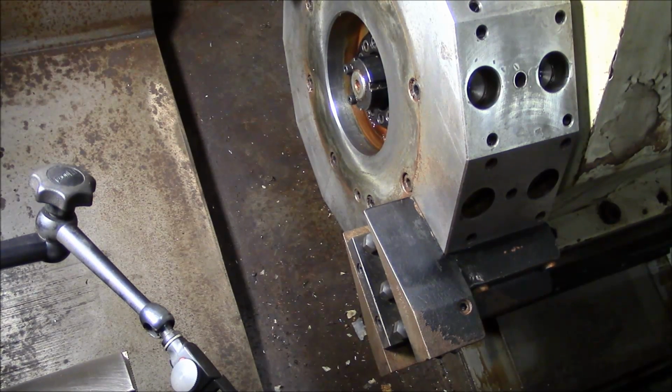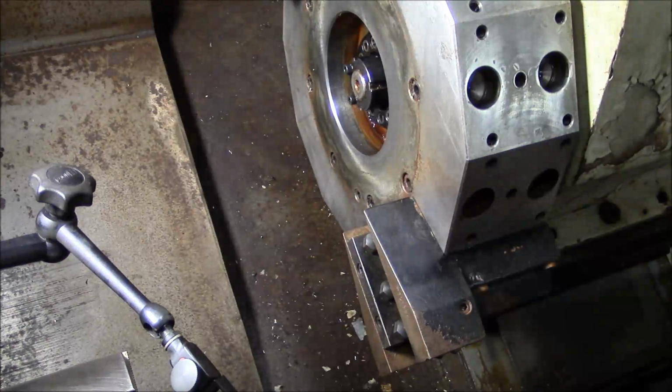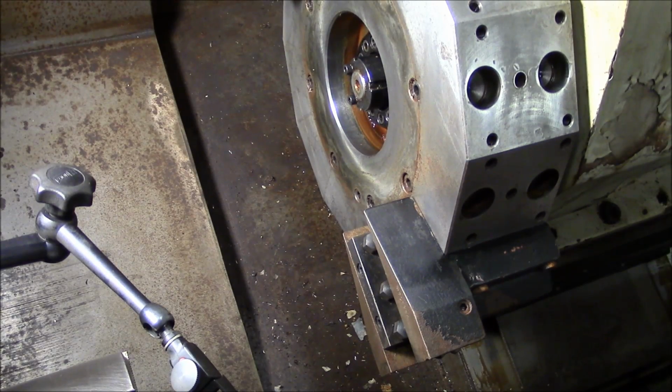That's a bad deal. Also, you know, the machine is inevitably going to be crashed. It happens to everyone. It happens to every machine. If things can slip, most of the time they don't break. Just the slipping of that curvic coupling dissipates a ton of kinetic energy that otherwise would be used to break something. So in the event of a crash, we want things to move. We don't want it to be perfectly rigid. There's a reason that they put all these joints in these machines.